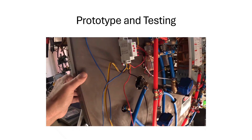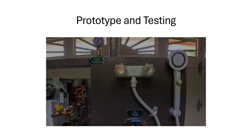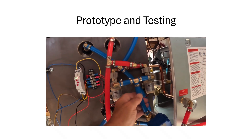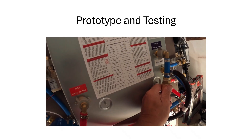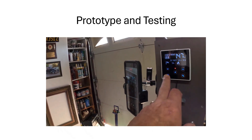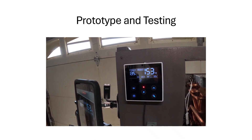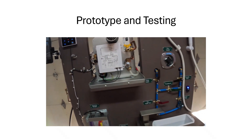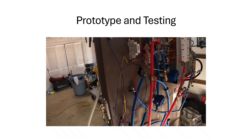I've got my timer circuit so that I just push a button and these two pumps stay on for somewhere around 20 to 25 seconds. So let me look at this side — this is the button I'm going to push right here. I think I'm a little bit happier with the two pump setup, and we're definitely getting hot water all the way over to my water heater. My inlet temperature starts to get too high, and the water heater is up to 151, 153 degrees. So this would be pretty much push the button once, get hot water to your faucet, and go from there.